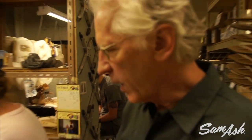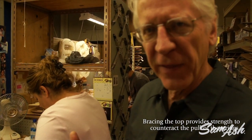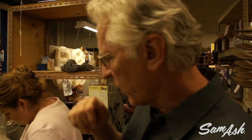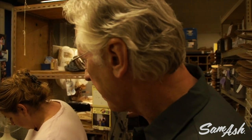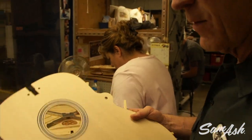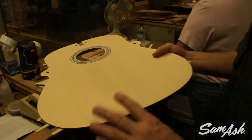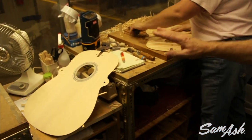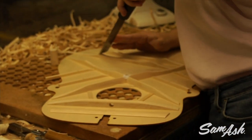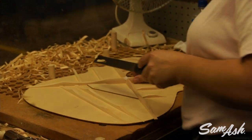The trick with bracing is to have them be thin enough so that they produce great tone, but not so thin that they cause the imploding of a guitar. So we want to walk the borderline between strength and tone. These are HD28V Vintage Series tops. They've been partially shaped already, and now the final shaping is done entirely with the chisel. And Diane is quite good at this — after 10 or 20,000 tops, they start getting the hang of it.